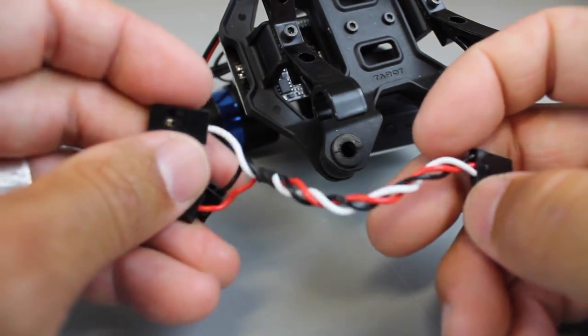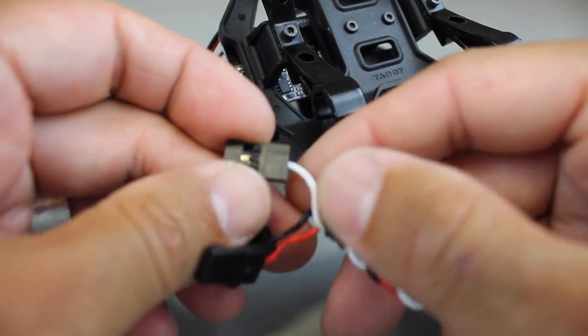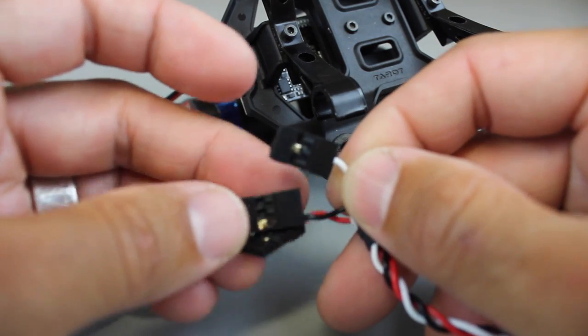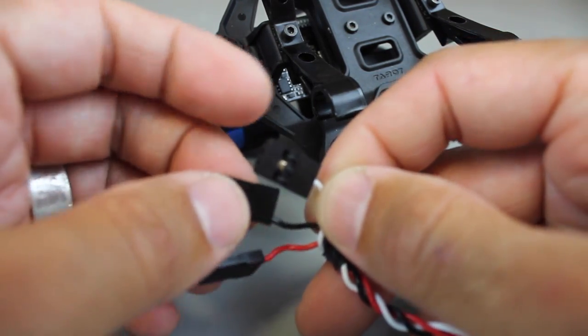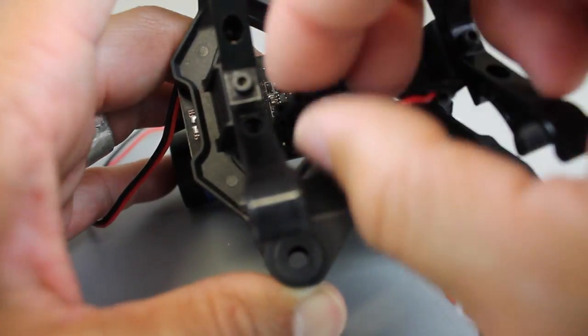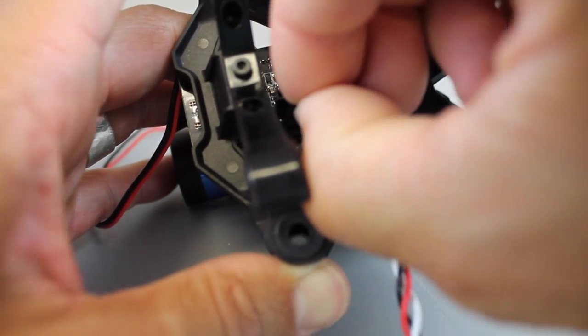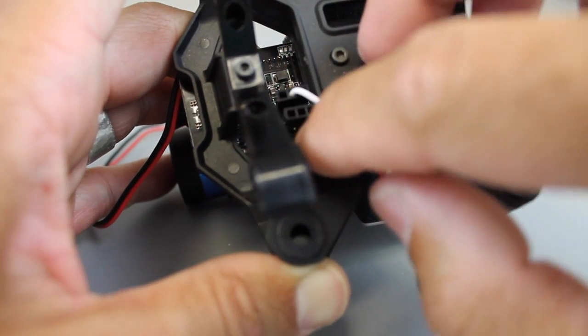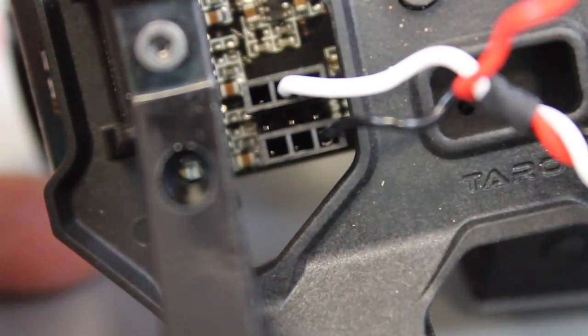For the signal pin I had to move it from one of the end ports into the middle, so that will allow us to get our tilt and our ground plugged in correctly. The tilt is the middle pin in the top row, and then on the third row it's P plus and minus. I'll connect the ground to the minus pin, and now our tilt and ground pins are connected.